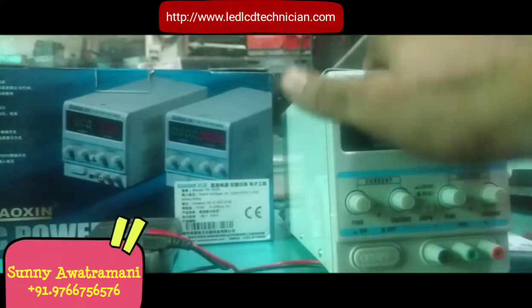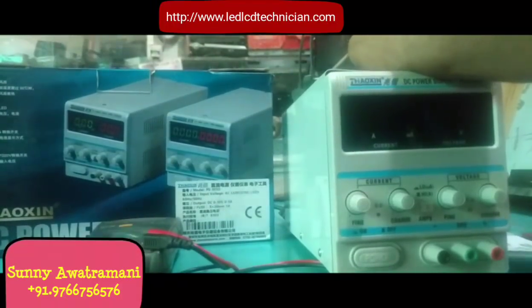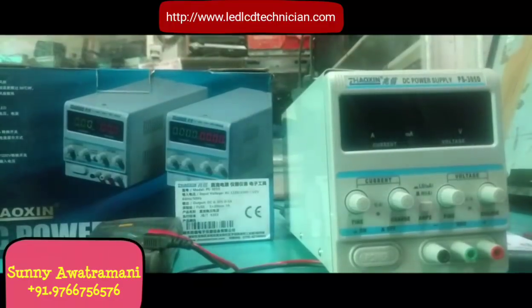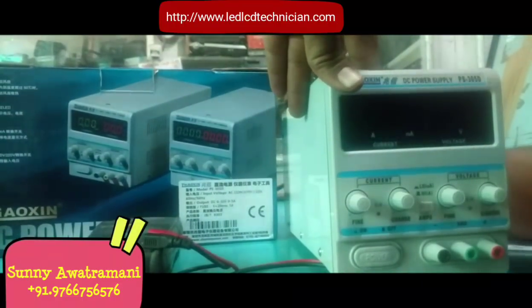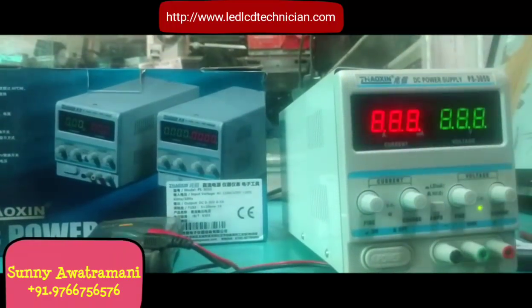You can give voltage to the PCB, or check IC voltages so that you can test the motherboard. For example, the IC may have 3.3 volts — you can check this. The main advantage is for detecting shorting. If you have a shorting on a motherboard, it is very useful. If you have an IC shorted on a motherboard and you don't know which IC is shorted, in this condition you can check. If the ampere increases, you know there is a short on the track — and it will get very hot in that condition.